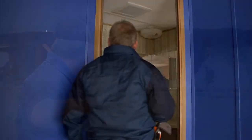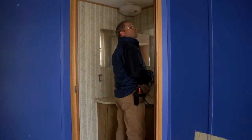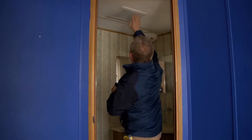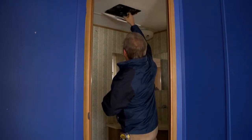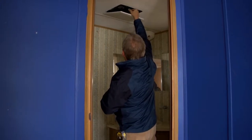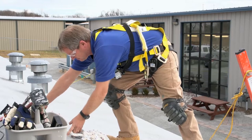It is important to note that before any roof cavity insulation can be installed, no matter the method used, you will need to determine if the ceiling is structurally sound enough to support the insulation that will be added. It is also imperative to have all ceiling penetrations sealed and new exhaust fans installed before the roof cavity is insulated. As in any construction or weatherization task, be sure to always wear the proper personal protective equipment, or PPE.